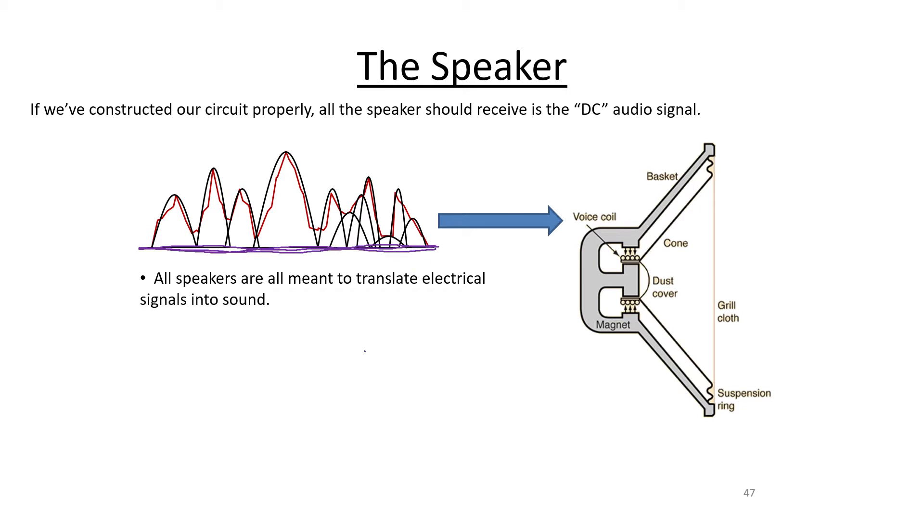The RC combination we talked about in the last video has filtered out all of the high frequency carrier stuff and left us with just the low frequency audio information. The black curves here are meant to show that essentially we're sending a whole bunch of different pulses of different lengths in time to the speaker, all the way to the right in our diagram of the radio receiver.